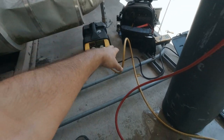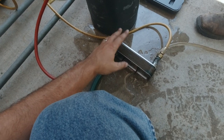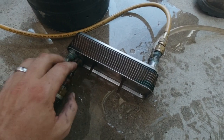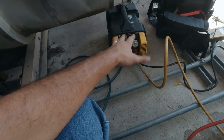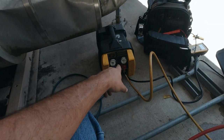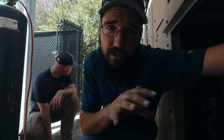I'm pulling out of the liquid line into the recovery G5 Twin, coming back through a custom subcooler — my own personal design that I built. We come in and do a counter-flow through a brazed plate heat exchanger, then come back out after it's been subcooled and into our recovery cylinder. If you've ever been doing a recovery and your machine starts to bind up and shudder, and your fix has always been to clamp down on the suction side — the reason your machine does that is too many restrictions on the discharge side of your pump. Things that slow down your recovery include core depressors or cores anywhere in the system. I always make sure I pull my core depressors out of my hoses so they're nice and open. Quarter-inch hoses are big enough to flow full liquid through the machine without any problems.